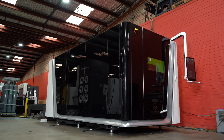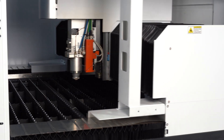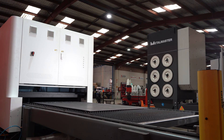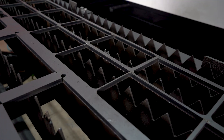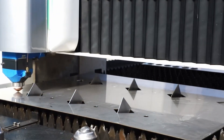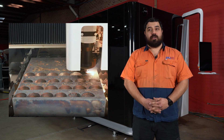The C-Series is the cost-effective sheet metal unit which has a 1.5g acceleration and 100m a minute maximum linkage speed. The standard features on the C-Series are a 21.5 inch display with one-click processing, interchangeable beds for seamless operation, lightning piercing for rapid and accurate cutting, intelligent remnant layout to reduce waste material, and visual collision and obstacle avoidance for the safety of the laser head and the operator. The C-Series machines can be fitted with up to a 60kW laser capable of cutting a super-thick 80mm plate.